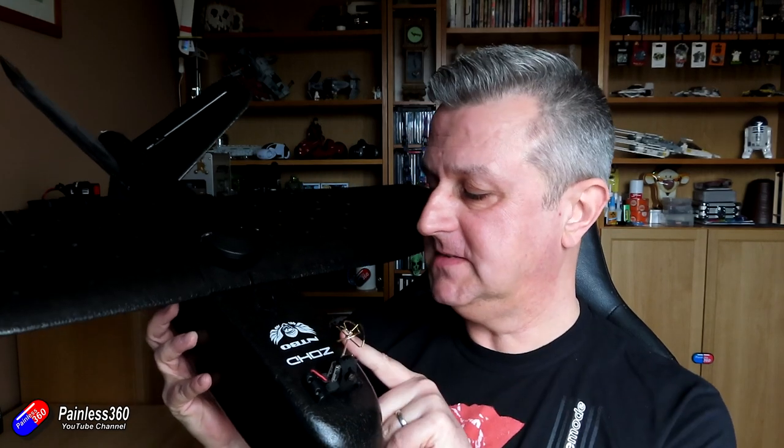Make sure you have a manual flight mode, Fly-by-Wire A, and circle mode set. Manual mode gives you something to go back to if you find the direction of the controls or correction is set up incorrectly. If you follow this video or the wiki that shouldn't happen, but having manual mode is just a safety net. Once you're very happy with it, I would normally turn that into launch mode — which allows you to launch the model — and I'll cover that in a future video. Fly-by-Wire A is a great mode that feels like flying on rails; we'll need to do a tune, which we'll cover next video.